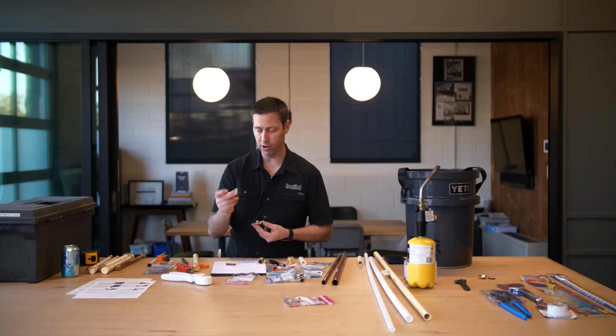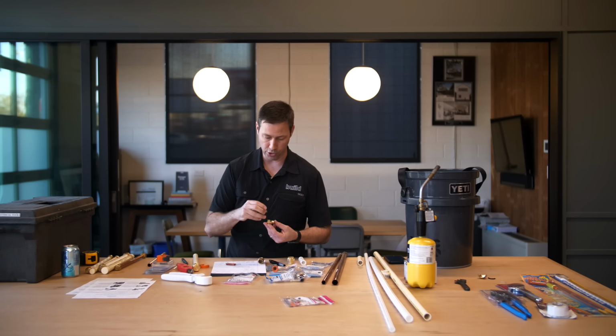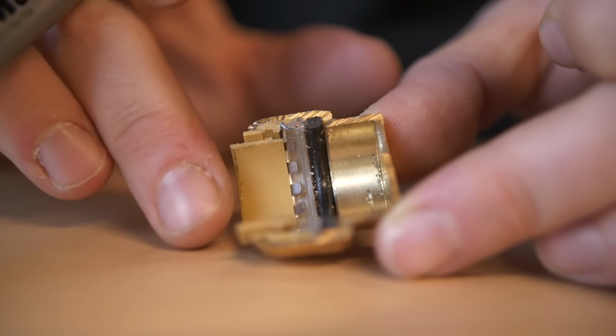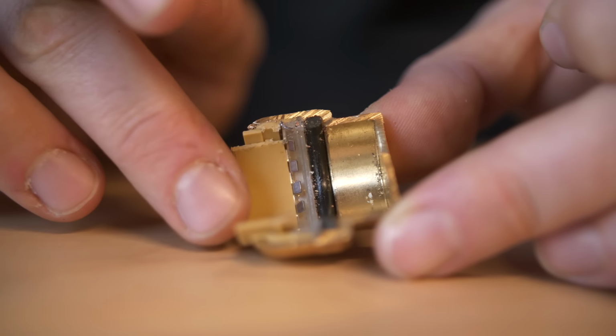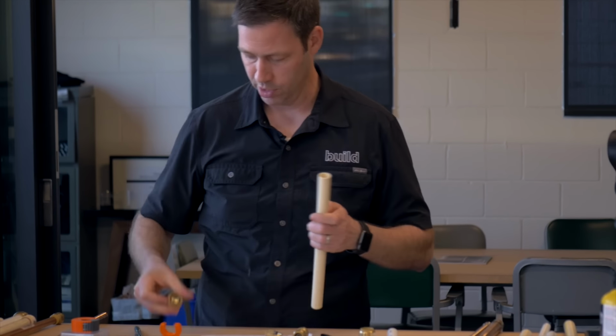Now, a couple things here you want to notice. This one has an inner kind of pipe wall. If you're using PEX, you've got to make sure that's in there, because this is going to stiffen it up and make sure the PEX wall can push hard enough against this to make a good tight seal. The other thing that's cool about this is if you notice this plastic piece right here, you can actually remove these. If you put a removal tool on here, we can pop this thing right off